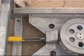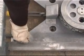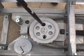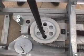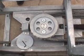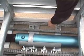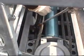Next, you should continue pulling on the mobile sheaves until you can replace the shear bolts in the front cylinder sheave assembly. Performing this after you have the spelter socket attached will let you put some tension on the cable. Reinstall the anti-rotation pins in the sheaves. You will need to line up the holes for the pins to be reinserted. There are five locations that these pins must go through. When the pins are flush with the center pin, you can put the cover plates back in position. Check the cable to see that it is taut. The cable adjuster eye bolt can be used to slacken or to tighten the cable during or after resetting.